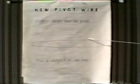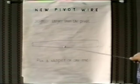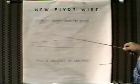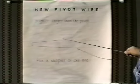I'd like you to select the pivot wire about a thousandth or a thousandth and a half larger than the existing pivot. Say the pivot was fifty thousandths in diameter — I'd like you to select one that's fifty-one to fifty-one and a half thousandths. I'll explain that a little later on as we go along.